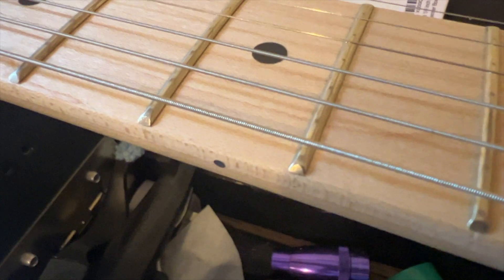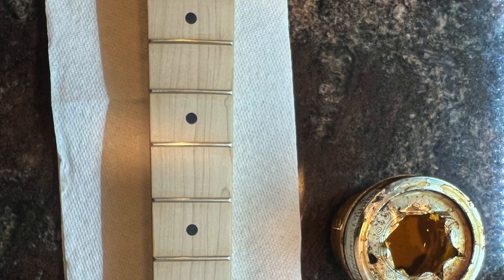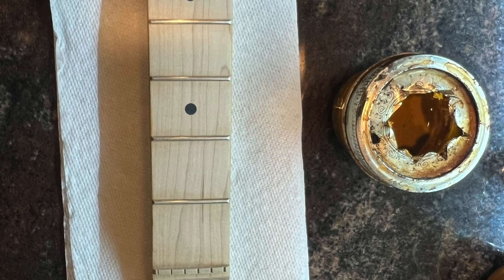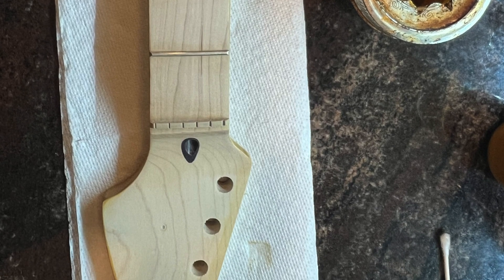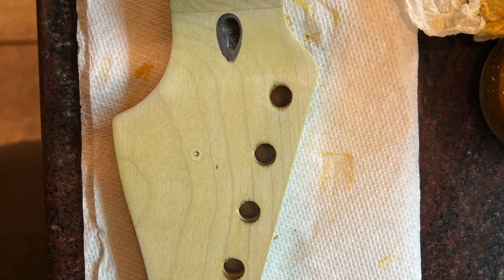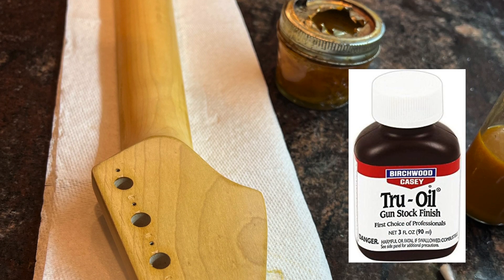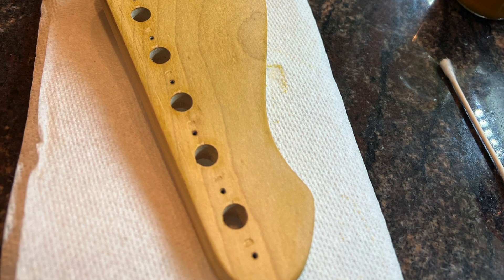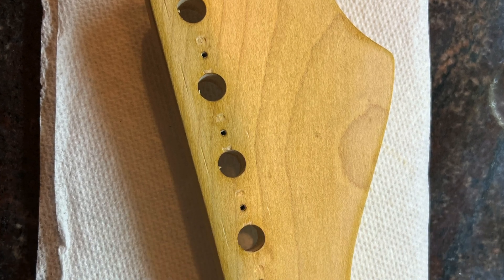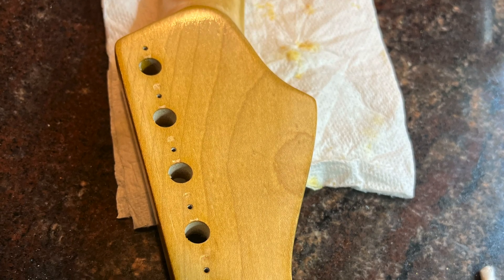I did have to do a little polishing. I took the neck off and the first thing I did was start to stain it. I have some vinegar and peroxide that had soaked with some steel wool. It really creates a nice dye that starts to yellow up and even greened up a little bit in certain ways. I sanded it down in areas, laid some on, took it off, laid it on again, and added some true oil. Eventually the best thing about the guitar became even better. The neck now is a joy to behold — it looks great, feels real smooth. I'm really happy with how the neck came out. It's got that aged look.